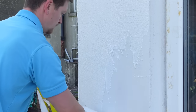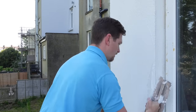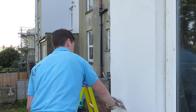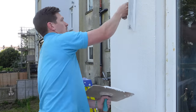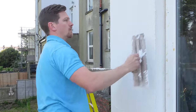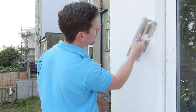We're applying a tight coat, working towards the beads. I always apply a thin layer to the wall, and then once it's been applied, I always scrape it back using an open trowel — pull the render right back again — removing a lot of the top coated render. This means that when you come to the later stages, you can really pull it back nicely.